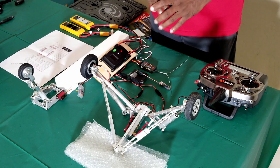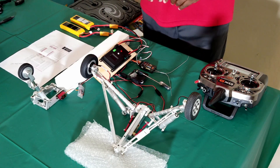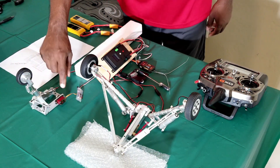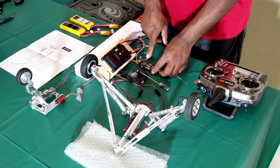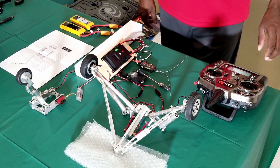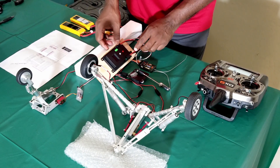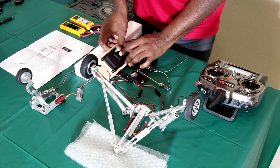The first thing we are going to do is test the most important main components as laid out on my table. What I am going to do right now is connect the main landing gear and test the brakes, and also the front landing gear. I also connected the steering to the rudder control, and also the elevator. Let me explain how it works. First, let's get the remote started, and then I am going to start the control system of this particular jet — which is the white button and the plus button. I have marked it in green just to make sure I can see it clearly — hold the white button and press the green button for three seconds and it will come up.